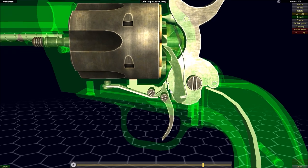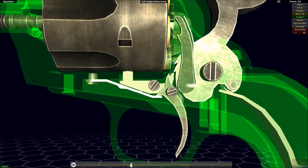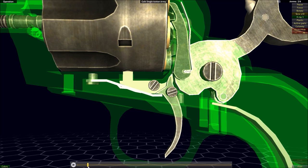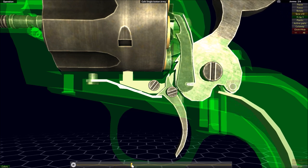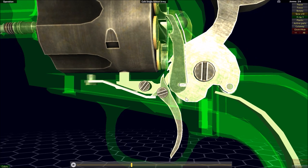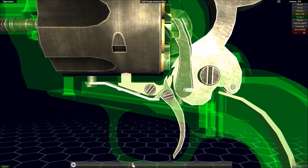As you can see, the connection between the hammer and sear is really not that firm. But with the half-cock notch — the full-cock notch is just a straight ledge, whereas the half-cock notch is actually a much more angled surface, so it locks in there more solidly, making it a little bit safer and a little bit harder to trip off inadvertently.